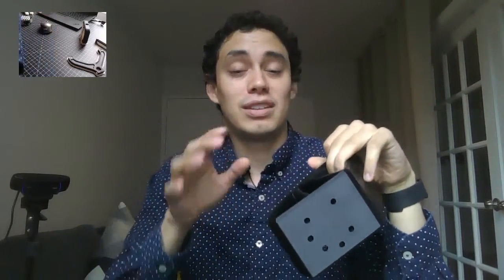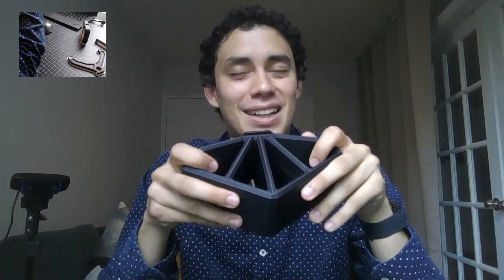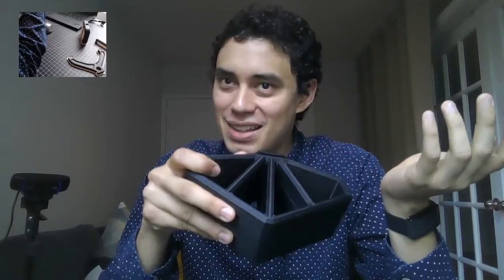Third question, what are the best print and bed temperatures for ABS? As I said before, and this is also related to the heat deflection temperature, the material is going to withstand all the way to 85 degrees Celsius before it starts to be malleable. That in turn means that you have to go above that value in order to be able to print it. So we are printing ABS in the extruder at around 250 degrees Celsius, and the bed itself gets to 110 degrees Celsius, the chamber as well, to keep that material warm and happy as the printing process is completed.